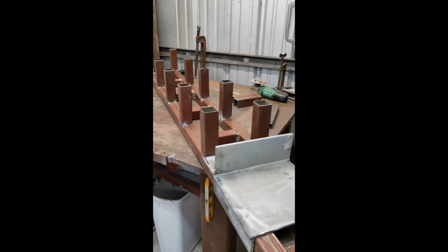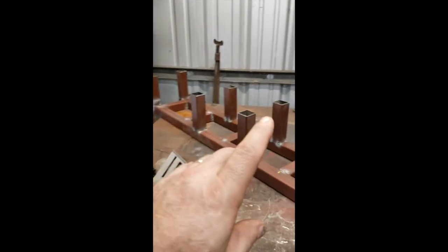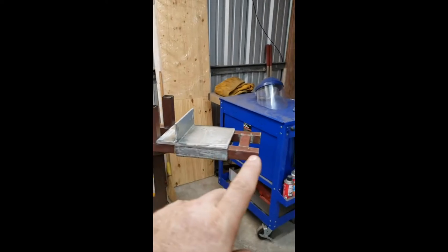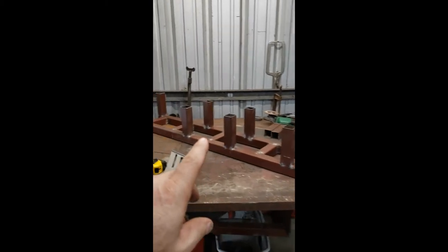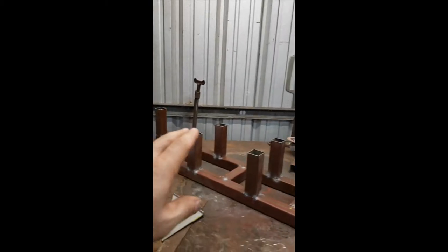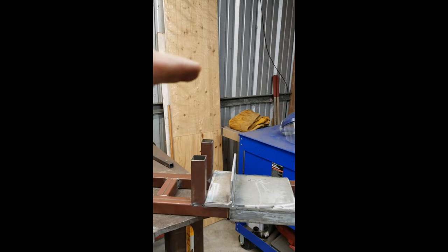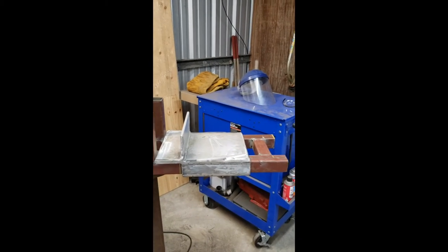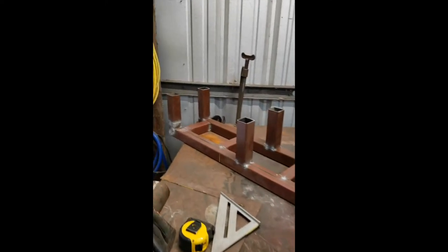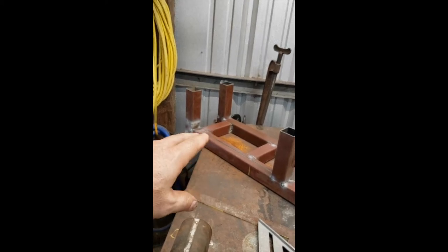I got the saw head assembly off and have started trying to figure out how to finish bracing across and building the whole thing out. I've got these seven-inch risers that I've put across here. Instead of triangulating this thing, I've decided just to square it off, because I'm a little concerned about making it too tall and hitting the top of my carriage. You can see that I have all of the uprights welded on — I had to splice one in because I made a cut thinking I was going to make an angle cut and had to fix that.